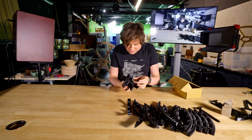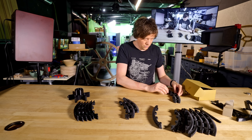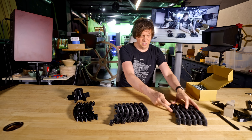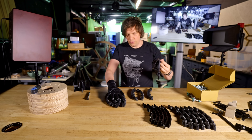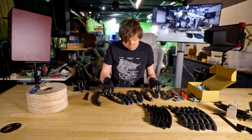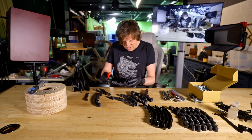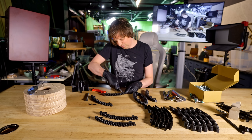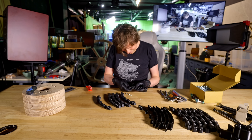Let's check the bearing — the bearing clicks in, that's nice. This was an early one with two small holes, let's put that aside. So we have six of those, and then I have these support pieces, six of those too. When breaking off supports from these PPA carbon fiber filament parts, I'm using nitrile gloves just to not have the carbon fiber strands go into my skin — I think that's a good precaution. Sanding carbon fiber components requires a lot of caution, so I'm just going to break off the support and not sand down this surface for now.